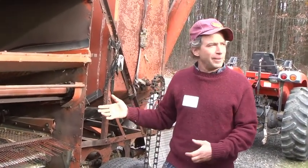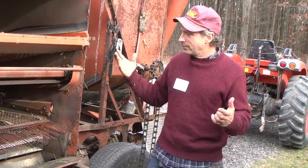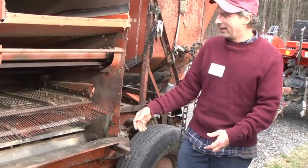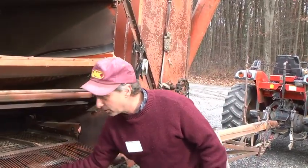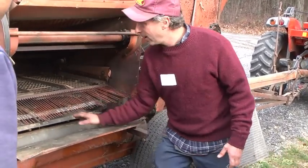So I would say make notes about how you adjusted the combine each year and what worked good. If you're getting a lot of extra tailings, say, what did you do? Like, where did you set your bottom sieve, or if you were getting too much in the tank?